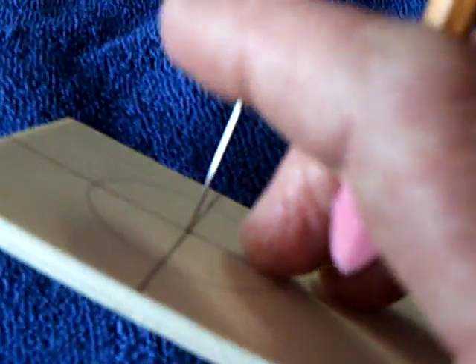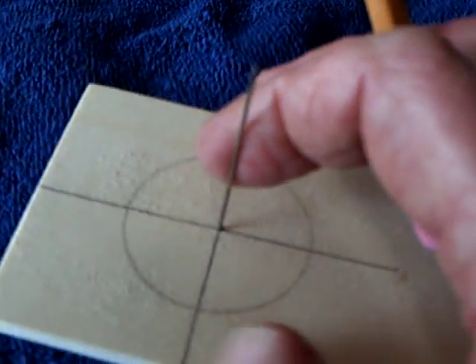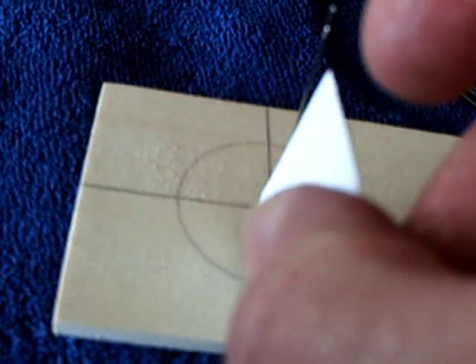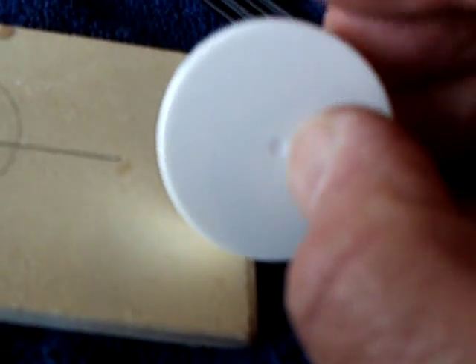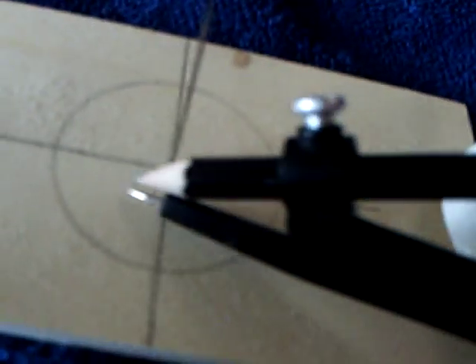The way I did mine is a little different. I had a thin piece of wood — I don't have a drill press in my house — so I thought that killed the idea. But I found out if you very carefully shove a big needle through a thin piece of wood, making sure both axes are parallel, and then find a lid that has a dimple on it, you can put a hole in that dimple exactly. You can get it perfectly aligned if you use a compass to draw the diameter of the lid on the board, line the lid up perfectly, and get that needle exactly perpendicular in both directions. Then put a drop of crazy glue on it and seal it up — that makes a really nice rotor for these micro-amp little projects.